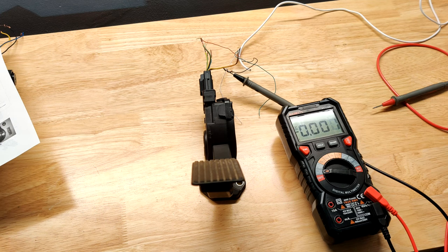The good thing about using a current-limited power supply is that you're unlikely to do any damage to your Hall Effect sensor. Even if you do wire it up wrong, it's not going to be a big deal.